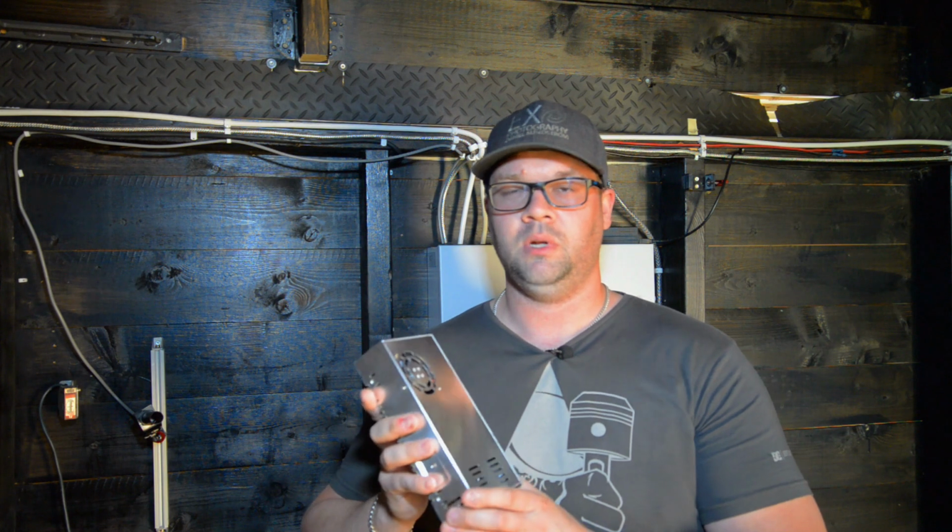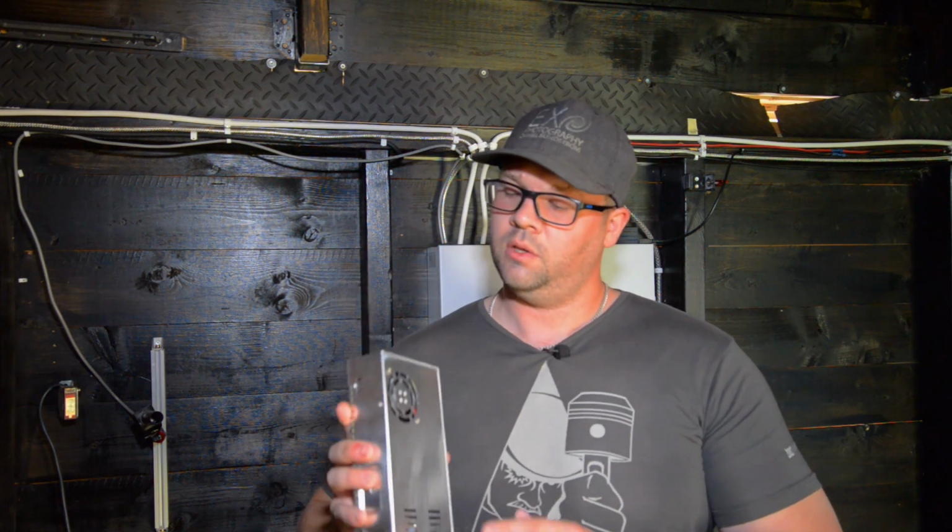I don't use anything else but the Meanwell. This is a highly recommended brand. It has a very low ripple, so it's a very stable current. I have seen a lot of these unbranded Chinese power supply units. You do not want to use them. I have used some of them on a cheap LED strip and it burned out on me, so you do not want to use them. Meanwell has been working for me many years, not a single hiccup. This has temperature controlled cooling and they are really good. So today I'm going to change to the new one.